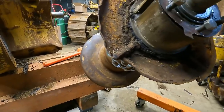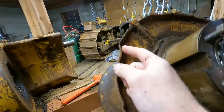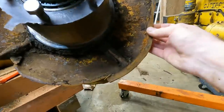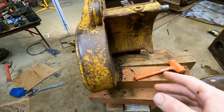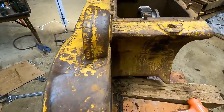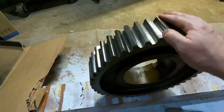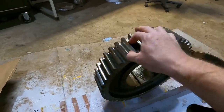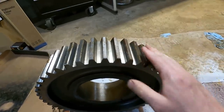In here there's a seal which there is a replacement for - it's quite expensive but I'll definitely be replacing that. I'm still thinking about the best way to fix this. The best case would be just to replace the drum but I'm never going to find that. So I think I'm going to come in here and just tap all this out - some of this looks pretty bad. I'll heat it up and tap it out, and then when I get it back in the winch if it's folded way out I can just tap it in so there's like a sixteenth of a gap, just so it doesn't drag. The teeth on this gear look really really good - some surface rust on top but the actual tooth face looks really nice, no chips. This is like brand new.